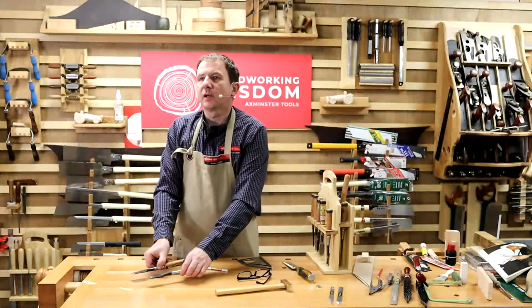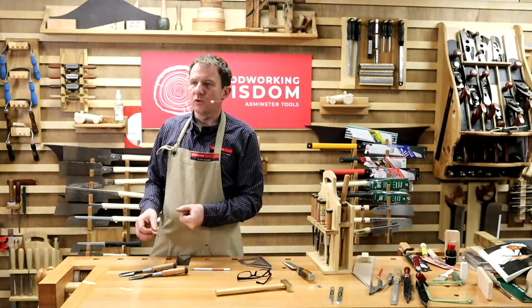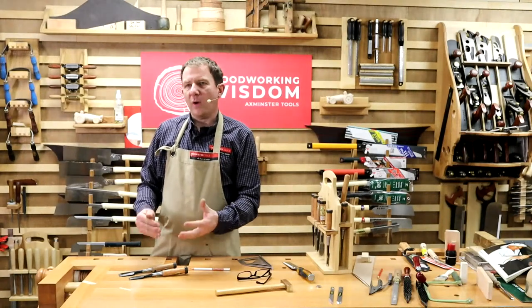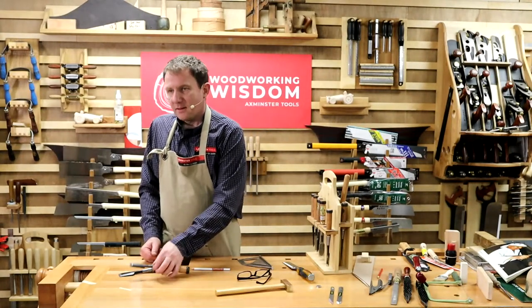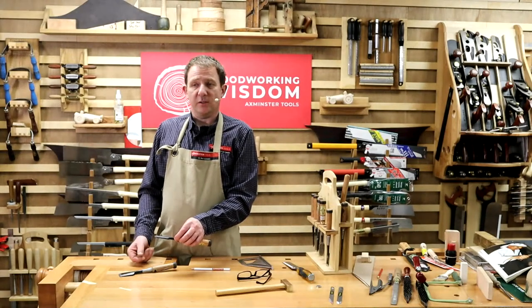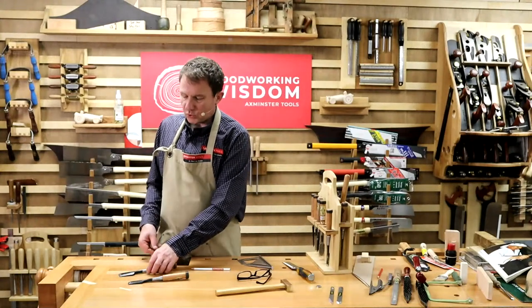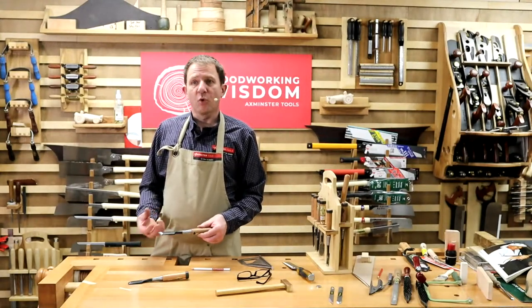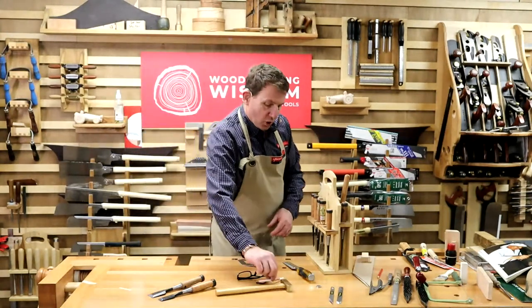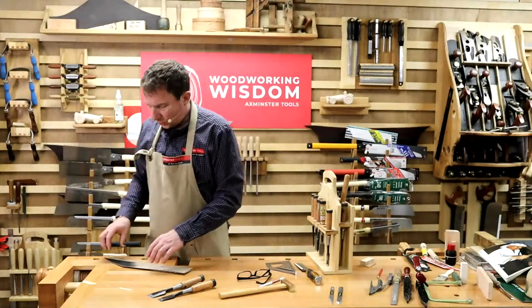Now, other things which are more difficult to explain: when I spoke about the high carbon steel, depending on what they use with it, as in a material they can add, so you can have carbon, tungsten, you can get different grades of that steel. The basic chisels we do, from what I understand, are classed as white paper steel, that's what they class it as in Japan. That's hard wearing, it will hold its edge. If they put more tungsten in, they get what they class as a blue paper steel, which is more of an alloy. So again, harder, so it'll hold its edge well. So we've got two different types of alloys on those chisels, which leads to one problem that I know we get: you've got quite a brittle edge.